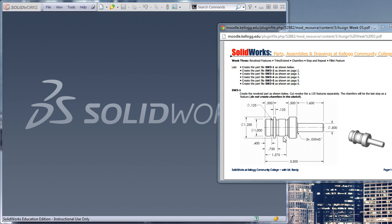We have a small pin here, a rather complicated little pin that we're going to create with a revolve and a cut revolve. Again, a reminder, read your directions carefully. You'll notice that this says to cut the diameter 0.125 features separately. If you put them in the original sketch, you're going to have to redo it, so make sure you cut those separate. And again, the chamfers will be the last step as a feature. Do not sketch any chamfers or any fillets in any of these parts.